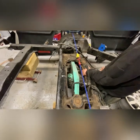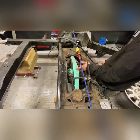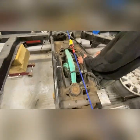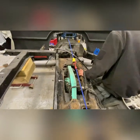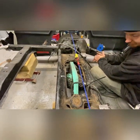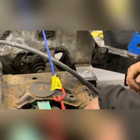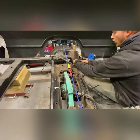For my racing I'm going to have a couple of subframes built up for this year, all with different ratios — rather than changing the diff — different colors as well. They'll just be drop-in, drop-out jobs so it'll be a lot easier. We're not just going to leave the old brackets like that — we're going to put some triangles on the side to keep it nice and strong and stop it from flexing.